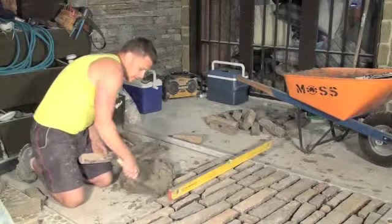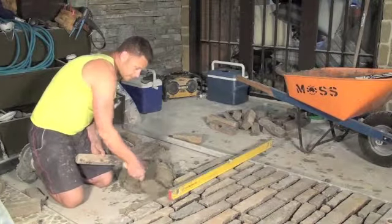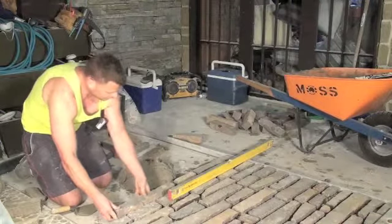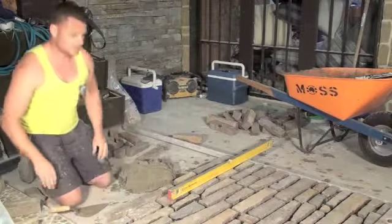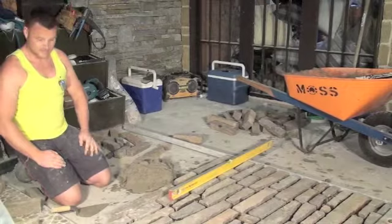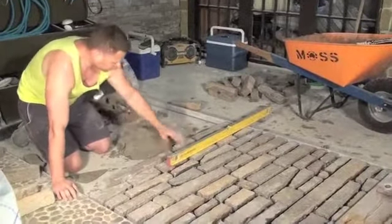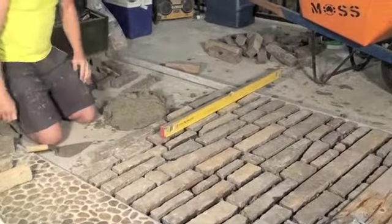You get your piece and it's very much laid like you would a walling stone, so we probably go for something a little bit bigger on this one. We're just following the height. The joints on this don't have to be squared off perfectly like you would with walling — it wants a very rustic effect. So we're going for anywhere between a 5 and 25mm joint, bedding it in and following our two gauge rods either side which are separating the products.